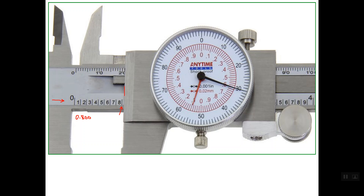Regarding the reading of the dial scale, the scale in black — which is the outer scale — is the inch graduation. The line in black is aligning with line number 3, so line number 3 on the inch scale represents 0.030 inch. The total reading for the inch system is therefore 0.830 inch.